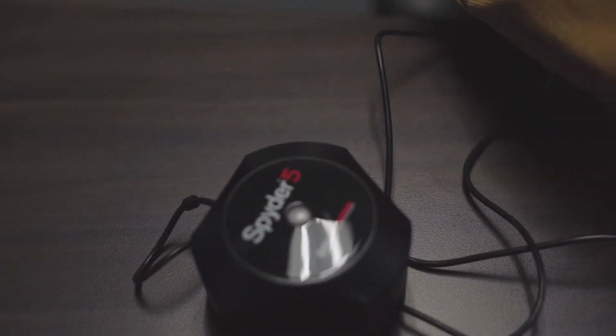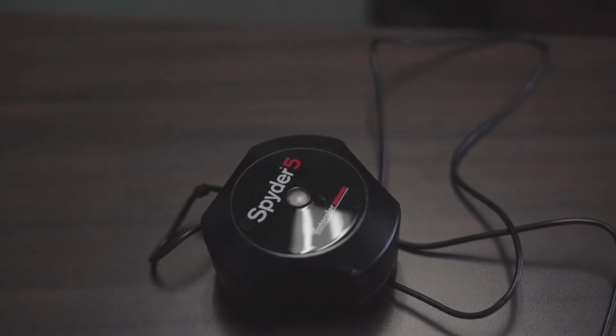Turns out spectrophotometers are actually not that good at reading black levels. Colorimeters are. So we'll often use both when we're trying to figure out the contrast of something, which is how dark something can get and how bright at the exact same time. That's an important measure, and one of the easier things your customers will notice. If a screen looks washed out, it has very low contrast. If it looks very punchy, with the darks dark and the brights bright, it's very high contrast. It's a very visually easy thing to notice the difference between.